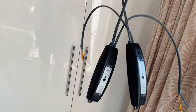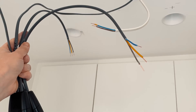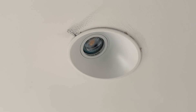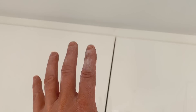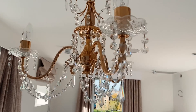The feeds are ready to go. The main feeds need to be connected together in a Wago box, and then these are the lights going in - they're Astro Lighting fittings with a 25-degree angle. As you can see they fit really neatly into the ceiling, very smart-looking and discreet. These are just going to angle light into the cupboards so they can see what's going on when they open them. The chandelier is connected up as well so we can get that going.